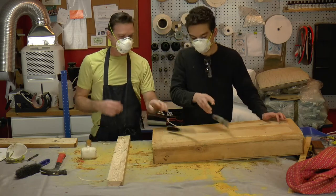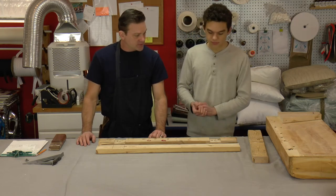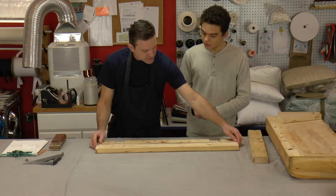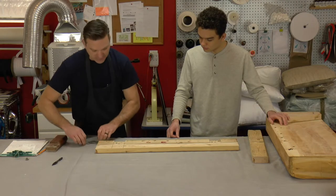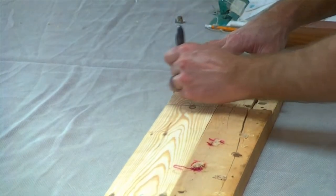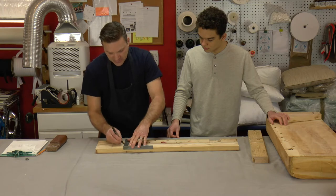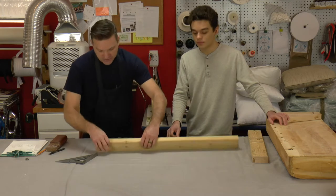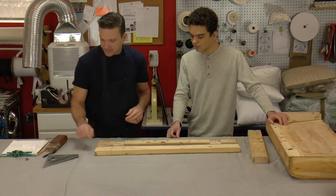We've cleaned off the arm - no more foam, no more glue, done. I cut the new board to length matching the old one, and I had to rip it down in width and depth as well. I'll lay this up here - I already started making two lines because this groove receives the leg, just as the factory had it. To make the groove, you take your table saw, bring the blade up to the depth needed, make your marks on the side so you can see where you are working.